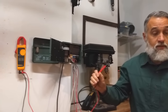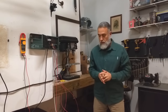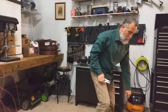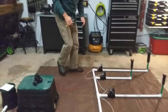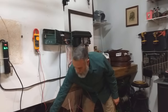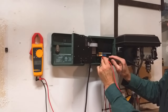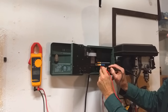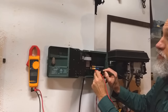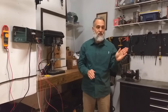So we've done two things: we ran the controller and saw it worked, and we tested the ohm readings on each one. Here's what you need to remember — if a dedicated line is cut, let's say we cut the dedicated line on zone number two, then we should get good readings on all zones except zone number two. Let's check: master valve is good, zone one is good, zone two is dead, zone three is good, and zone four is good. So if a direct wire is cut, it will take out that particular zone.